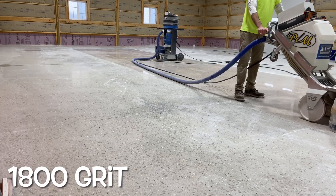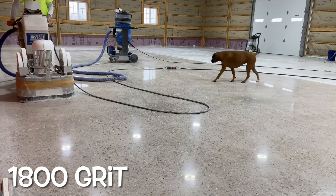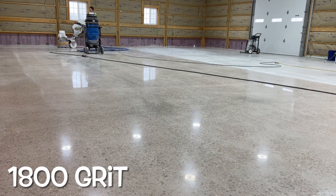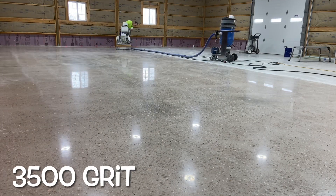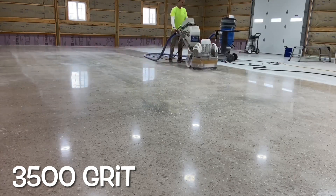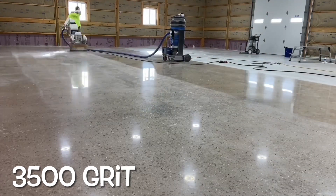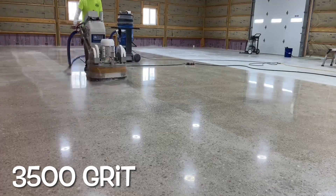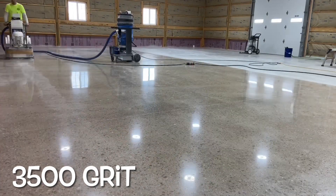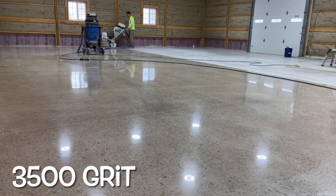The final result is a floor that's free of grout lines but exhibits decent reflective clarity. Most of the voids created by trapped air remain, but the absorbency of the sand, cement, and aggregates has been reduced. It's a chemical treatment method used to change a physical characteristic — and that's about it: densification of concrete to maximize surface uniformity and light reflection.